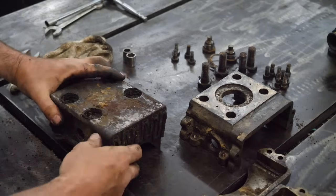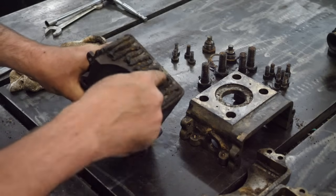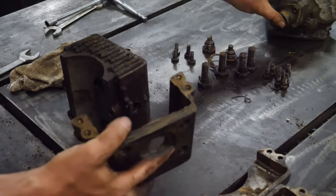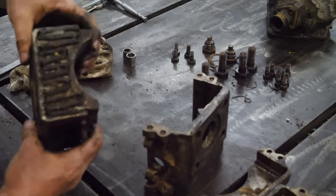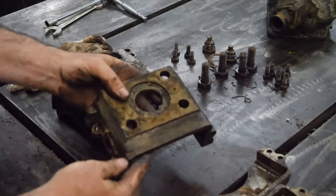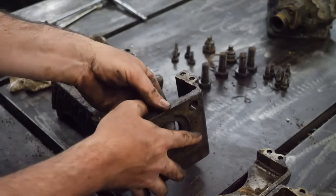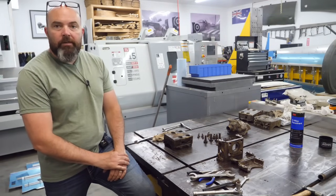A quick recap on the assembly: the inner steel shell fits to the spar fittings on the main spar for the Typhoon, bonded with rubber to an inner shell that is also attached to an outer casing, and the outer casing is attached to the aircraft's engine. I don't know if we're going to be able to salvage the inner two pieces, but the outer casings will definitely go for non-destructive testing. They look to be cast components, so if we can save those it'll save a ton of time and money. Both are now apart and need a thorough cleaning before sending them off for NDT.